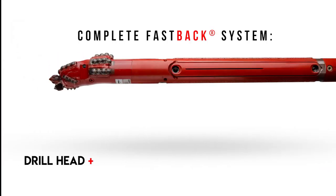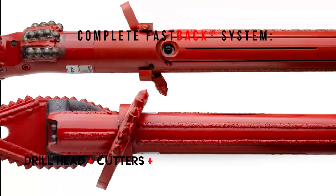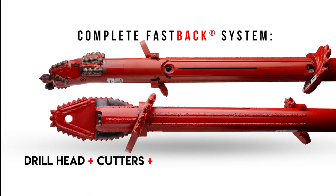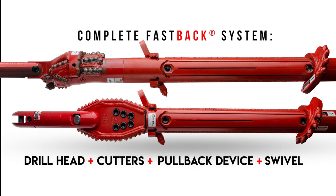The first component of the Fastback system is the drill head. The drill head consists of the SD housing with integrated mud grease port and your hard ground bit or directional blade. The Fastback cutter is attached to the housing on opposing ends. If you're cutting with a hard ground bit on a box-by-box housing, you'll need to attach the Eagle Eye pullback device for your swivel. If drilling with the steer face housing, you can simply use the quick swivel to attach directly to the directional blade.